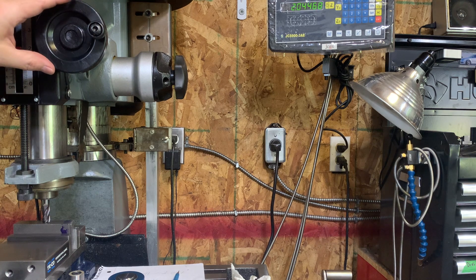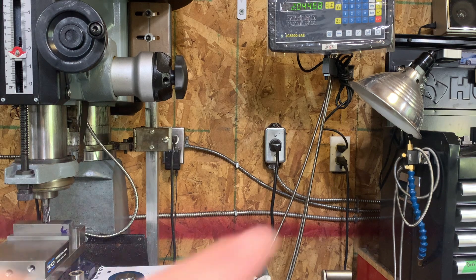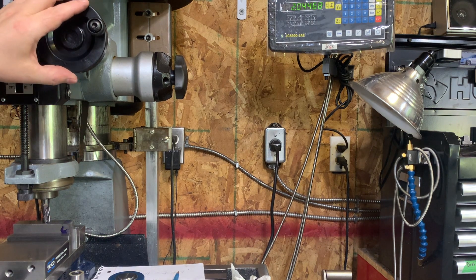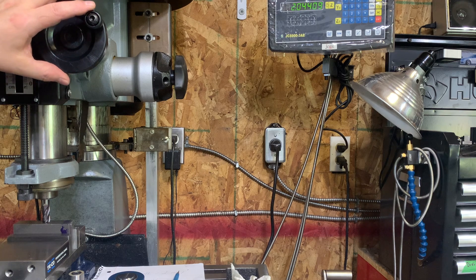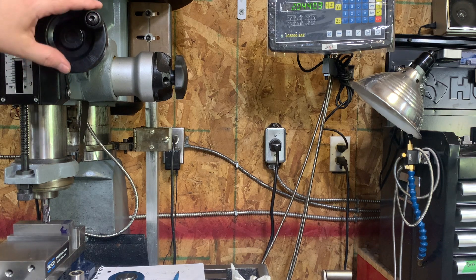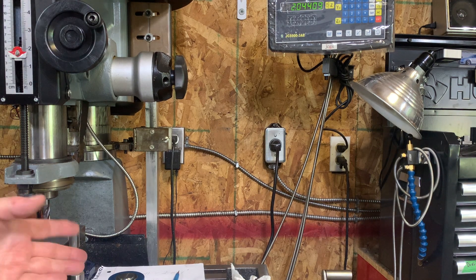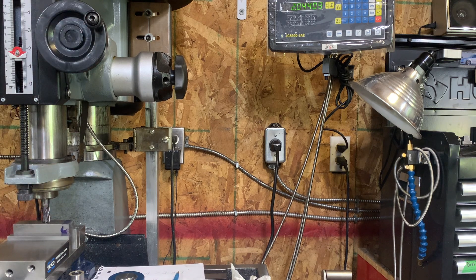I just touched off and I'm at two inches, forty-four thousandths, and six tenths. But that's six tenths — we're talking tenths, it's pretty subjective. So I'm actually touching here and I'm exactly at two inches, forty-four thousandths of an inch. That is going to be really useful for me — I can reduce the amount of mistakes that I make and get mostly accurate cuts in whatever I'm milling.